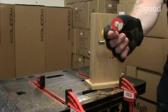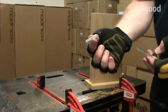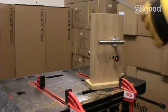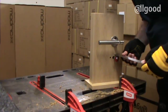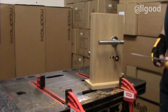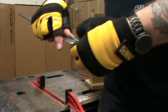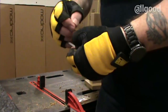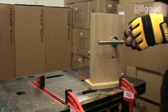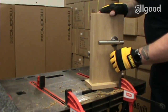Next is the indicator flag — red and white indicator, whatever you want to call it. It comes with a converter spindle which you remove and throw in the bin; you don't use it on this particular lock — it's only for use when using a thumb turn. Insert your spindle as far as it will go and measure from the face of the door to your flag. The outside surface of the flag in my case is 34mm. Remove the flag, measure 34mm, mark it, and then cut it using a junior hacksaw. I've now cut my spindle — make sure the flag retainer is tight — and it should now fit into the hole and go flush against the door.